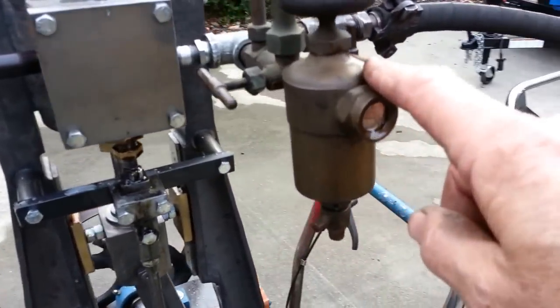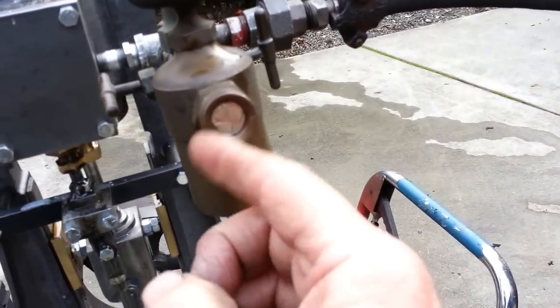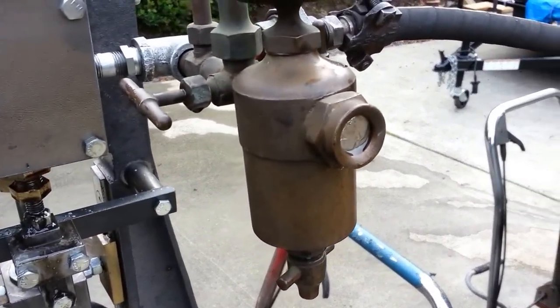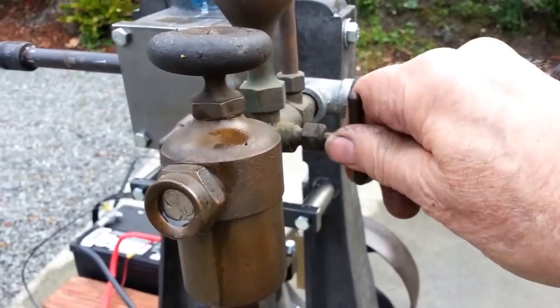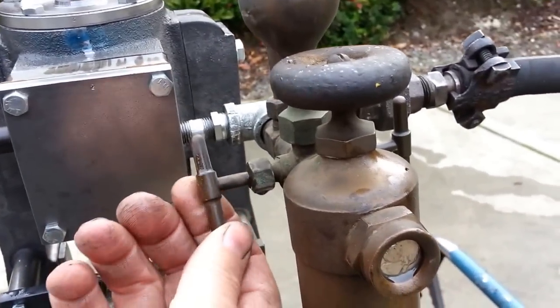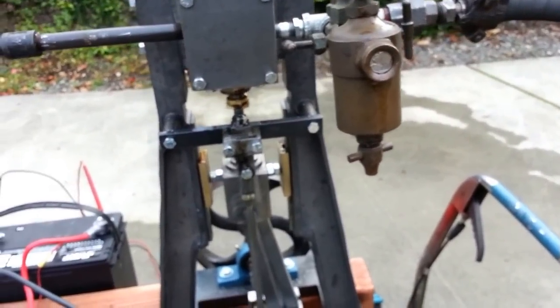The oiler — I need to put an oiler on it of course. There's a nickel in here where the water sight glass was, which you can't even see anyway. I know that was broken on this one — it froze. All I do is turn one valve on about a quarter of a turn, that's all it really needs. And of course you're going to need steam oil, and I'll help you with that too.